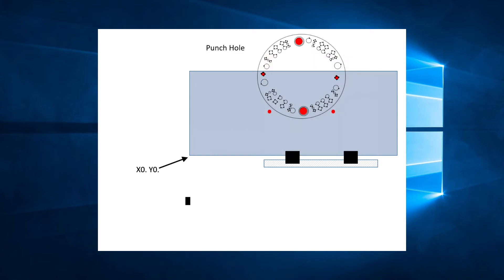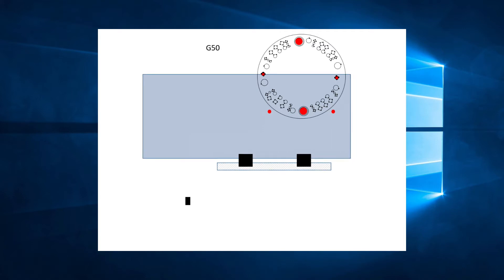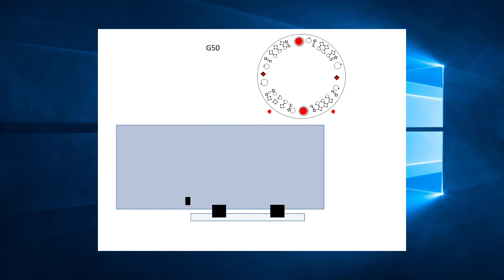Please take note that the 0,0 point or origin point of the sheet does not change. We are still measuring coordinates from the bottom left hand corner of the sheet. Now that we can reach X92, we can punch the required hole. That is all we need to punch, so the next line should be G50. If we execute a G50 command, the result is that 20 inches of the sheet will be hanging off the machine table on the left side. This is obviously very dangerous — if someone is standing there, they can get hurt by the moving sheet of material. One solution is to put a support table on the left side of the machine.